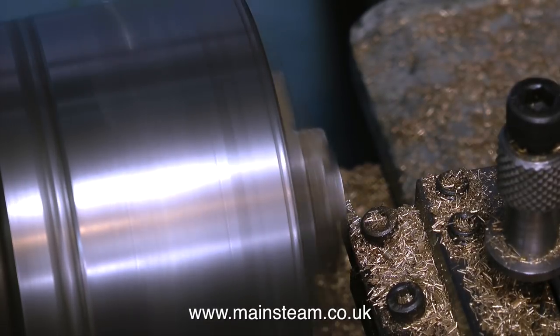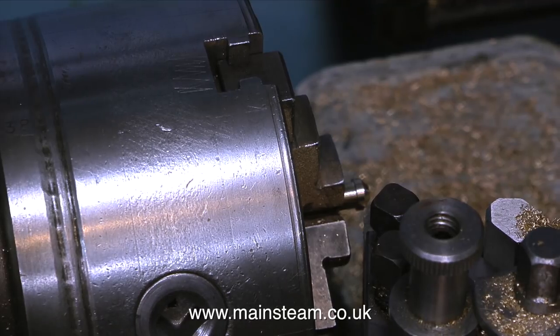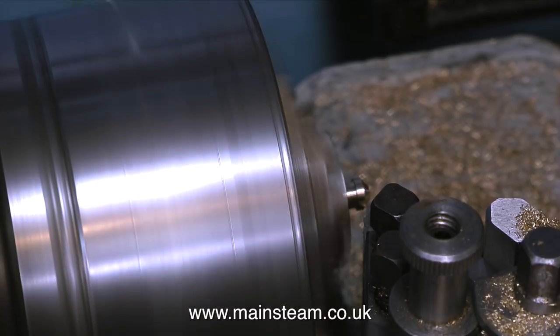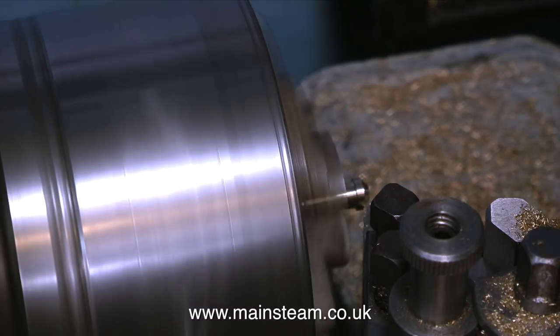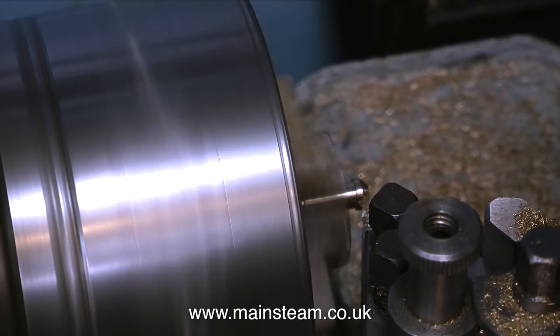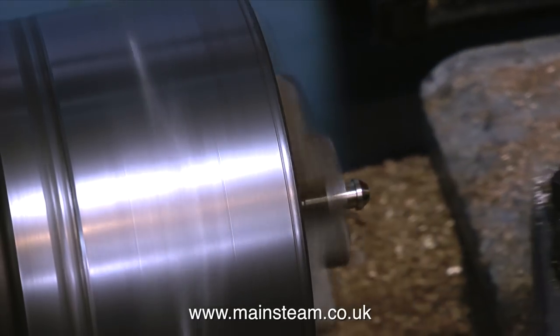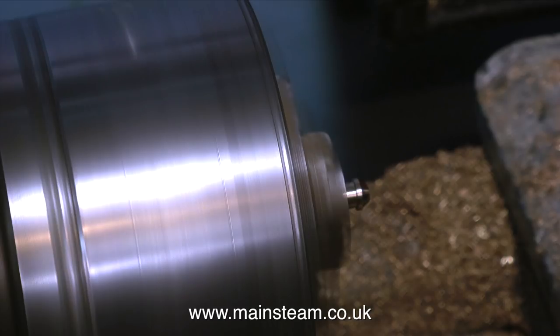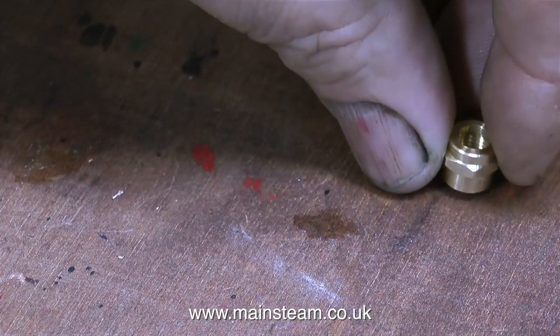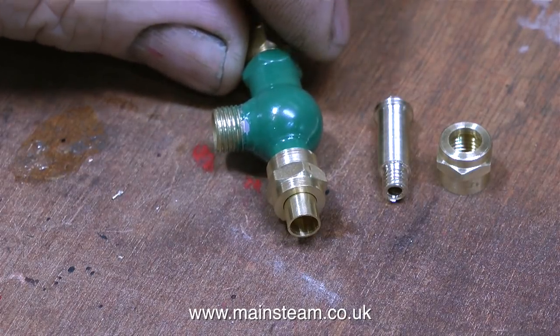You've just been watching me parting off the work, and I would normally put a small twist drill in the end to stop it dropping into the chip tray. To finish the job, I need to turn the end of the fitting into a cone, which will fit on the steam inlet of the tap and be perfectly steam tight, so the angle is very important. There are different ways to do this — the easiest is to get a lathe tool at the right angle, or grind tool steel to the right angle, or set the compound slide to the correct angle. But by far the quickest method for me was to use my standard 45 degree V tool, fit a commercial coned union into the chuck, then rotate the tool holder on the top of the top slide until I got the angle correct.